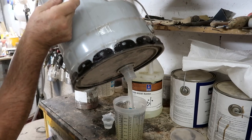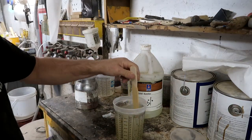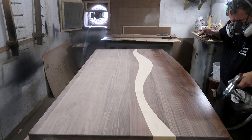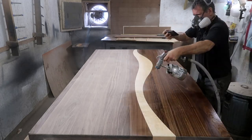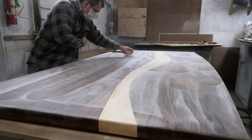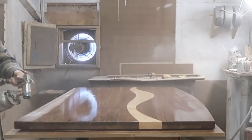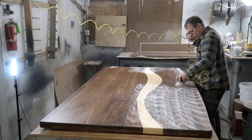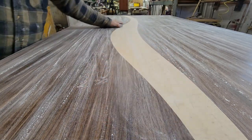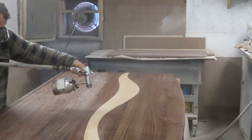Since this is in a kitchen area, I want a very durable finish, so I use Sherwin-Williams Conversion Varnish — a catalyzed system that is very resistant to water and household detergents. I spray two wet coats at six mils thickness, let it dry, and then sand thoroughly. I love this product — it sands really nice; you can really tell when it powders up. After removing all the dust, I spray two more wet coats, sand with 320 grit between coats, and sand with a hard flat block to be sure the finish is completely flat. I wipe all the dust off with a tack rag and spray my final coat for an off-the-gun finish.